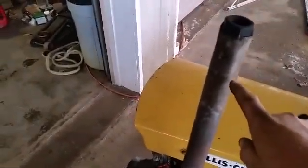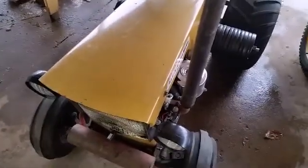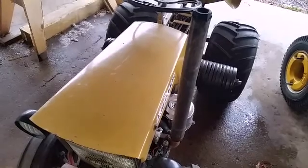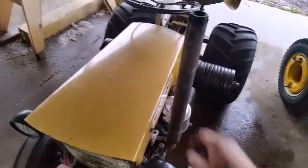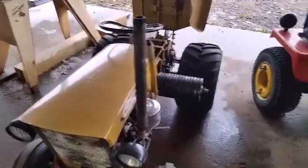This pipe actually has baffling in it. Let me come over to the other side so you can see it. The holes that come out of the pipe inside are down here — that's why there's more rust on the bottom half and the top is clean. There's actually a baffle in here: a pipe with a plug in it where the holes are in the bottom, and the nut is also a baffle. It's just enough of an exhaust pipe to keep it from backfiring when I throttle down. There are about twenty-some five-sixteenths holes drilled in the black pipe — plenty of airflow. It's not the quietest muffler, but it's better than a straight stack that just blows exhaust up in your face.